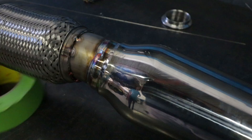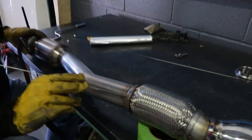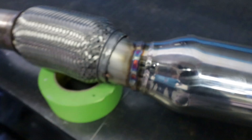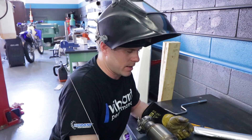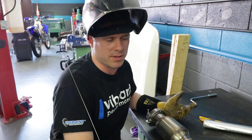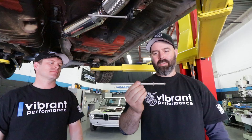So do real welders hate the expression 'stacking dimes'? Is that just something internet kids say? No, I don't mind it — these turned out pretty good. Usually I say those are 'mad tight welds.' There's a balance of how fast you want to get it done compared to how pretty you want it to be. Rule of thumb: the more work you do in fit-up and cleaning, the better the weld's gonna be. Anything that doesn't meet my own standards is purely because I brushed it or skipped a step. Prep and cleanliness go hand in hand with having a great weld in the end.